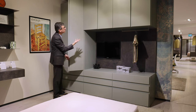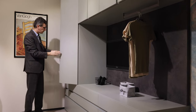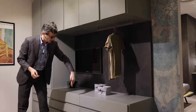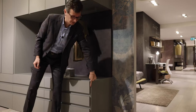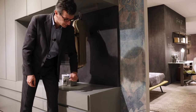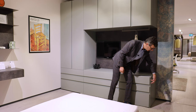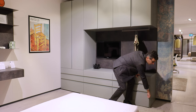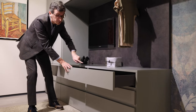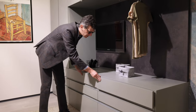We'll see the detail later. You don't perceive the partition itself when it's covered by two doors. We have a supporting partition here at the extreme left, another one here, hidden partitions here and here, and then another one at the end. If this composition were wider than the 264cm that it is, and had drawers going on from here, the drawer on its left would cover this part of the partition. If we open these two, you could actually perceive the partition I was telling you about.